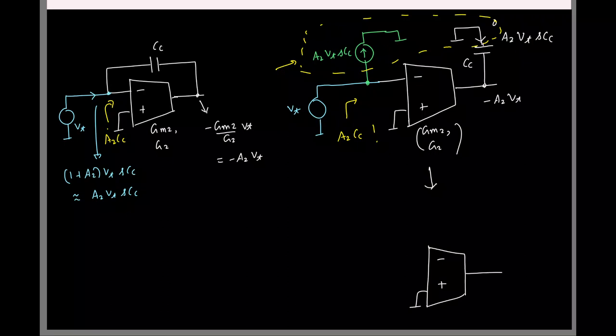So what I'll do is I'll take the capacitor here, just slightly redraw it. For the common gate current buffer, where should I give the input current? Source is the input. So let's say I take an NMOS. I'll feed the current to the source and the output current should be taken from drain. Right? So this is the output current. Of course, you need to bias it. So you put some current source here, some bias voltage here, and so on. That's all.